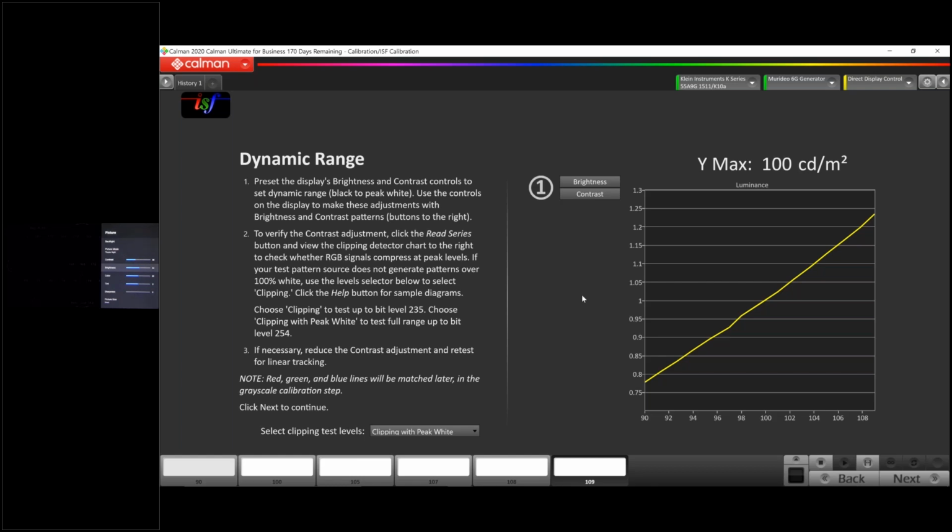So if we go up a click from 54 to 55, now I can see 17 just barely, and that's good. The problem is, though, I can also start to see the boxes at the bottom, and the background is starting to look a little gray. So I'm going to stick with the original setting that we came up with back in August at 54. Now, I have sacrificed box number 17, but at least the picture won't look washed out, which is okay.